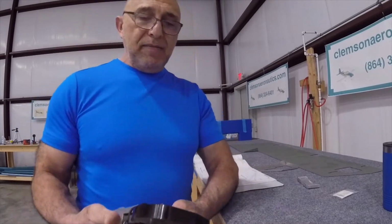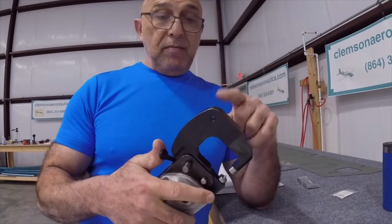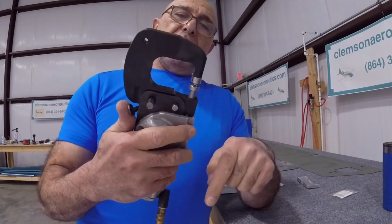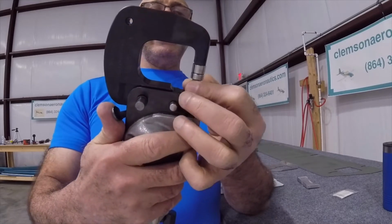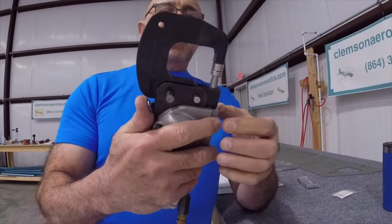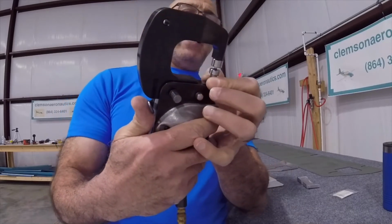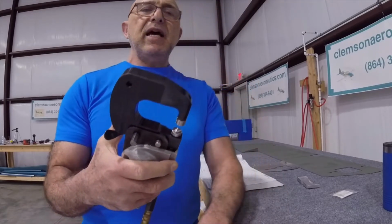So how do we set it up? We set up our, now this is advertisement for me, my longeron yoke, nice and thick. We put our dimple dies in there, make sure it doesn't close, and then we twist till it closes really tight while I'm holding it up. Then we let go. Then we make another half turn. We just come up really slow, and we see the flats. We're gonna bring them like a half turn. Now it's ready to dimple.